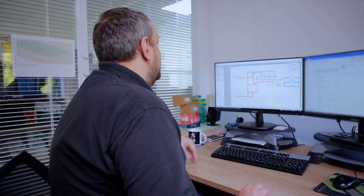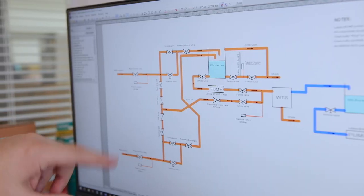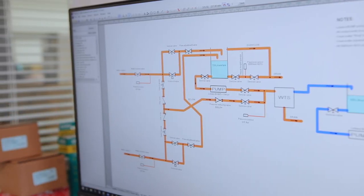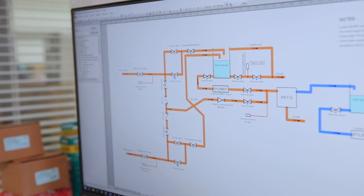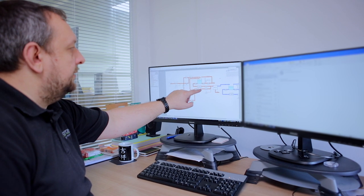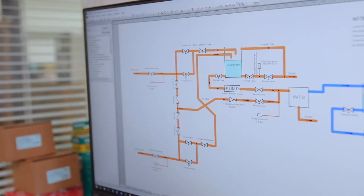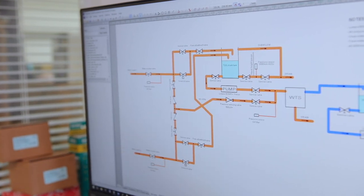Welcome to my desk. I left my colleague to do the work downstairs and I'll explain what the target is. As you can see on the diagram, we have two water feeds, we have means of measuring the pressure, and we have means of bypassing the pump if it fails through a water pressure reduction valve. The goal is to supply the WTS system — which is a reverse osmosis plant system — with as reliable a water supply as possible.